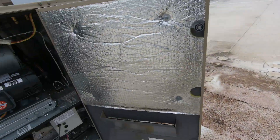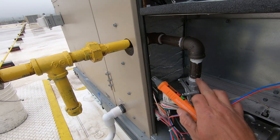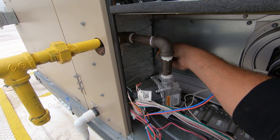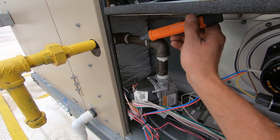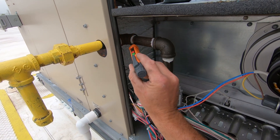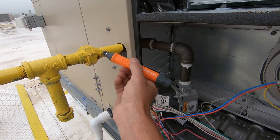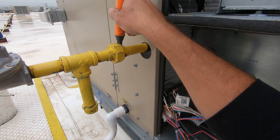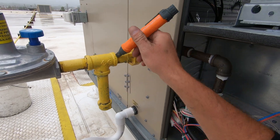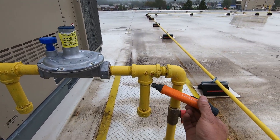I got the two apparent gas leaks tightened up. Got the union tightened up. Looks like they doped everything in here, but I'm just going to give it a quick hit with the leak detector, and if we don't pick anything up we'll move on to the next one. I'm not sure how this thing passed inspection — if it was inspected or not — but lots of loose fittings here. And just for the record, we did not install this equipment; we just got the contract to maintain it. Let's see what we got here — putting the TopTest to the test.